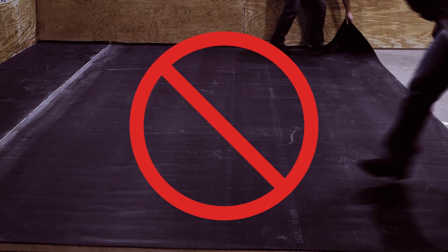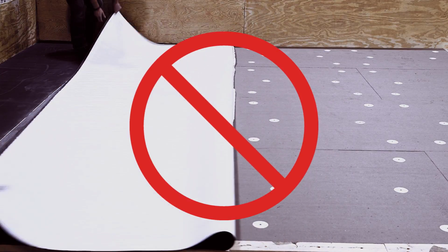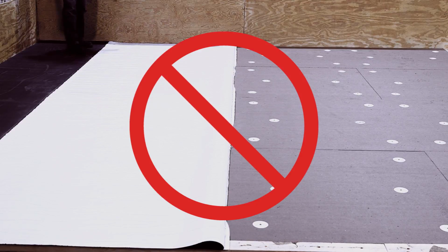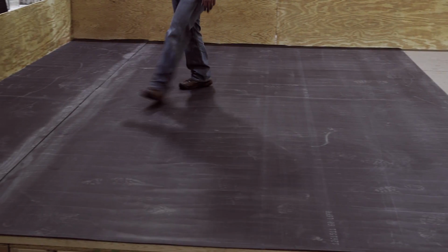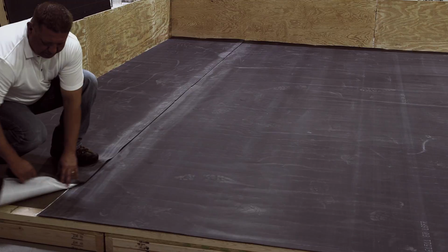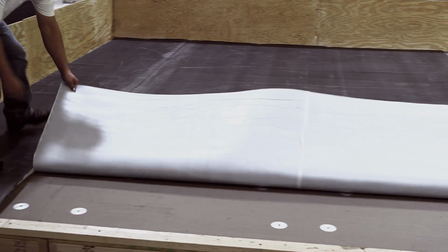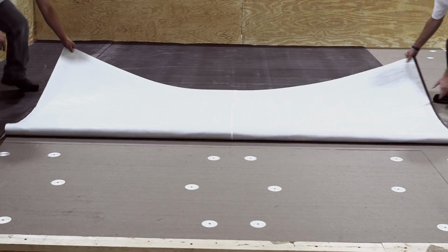Do not butterfly the membrane to remove the release liner. Doing so may cause air to be trapped. Instead, secure the membrane in its position before removing the release liner. Once the membrane has relaxed in place for a minimum of 30 minutes and the seam positions are aligned, carefully fold back the leading edge of the EPDM SA membrane at one end to expose the release liner without disturbing the original position of the membrane.